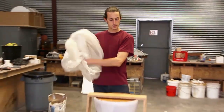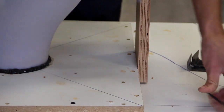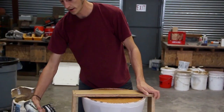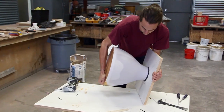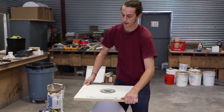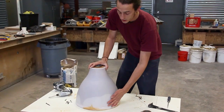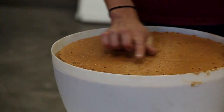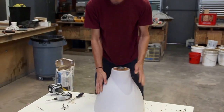So we're here today to demold the umbrella stand. First thing is to remove the plastic — the plastic was helping keep some moisture inside of it. First we're going to take this little frame off. Should just spin right off. This one we can reuse. You can see it's already starting to demold here. Since we haven't filled it all the way to the top, we have a little gap there that should help it knock right out.